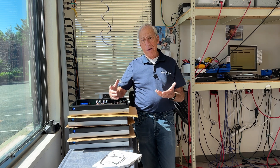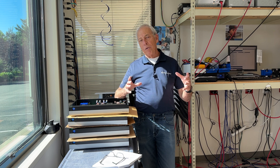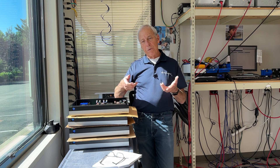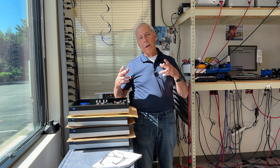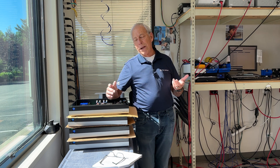What I think you're kind of falling back on is the old days with tube amplifiers. Those tube amplifiers have output transformers with different taps, so you could have a 4 ohm tap, an 8 ohm tap, or a 16 ohm tap. That's where you would plug your speaker in depending on its impedance. You could have done that with a switch — plug it into the binding post, click the switch to the appropriate impedance: 4, 8, 16 — life's good.